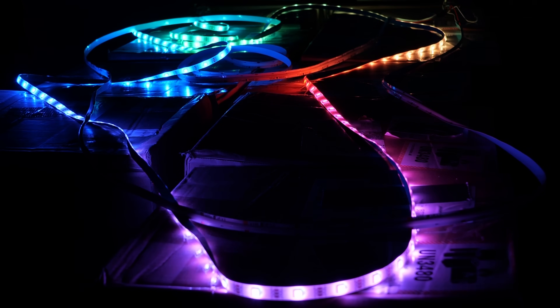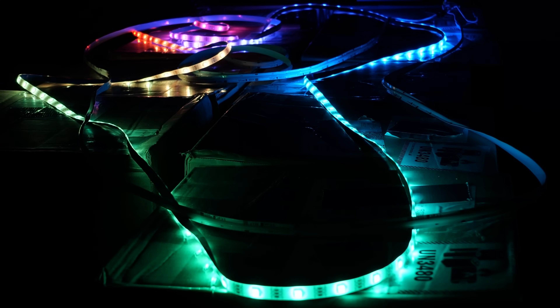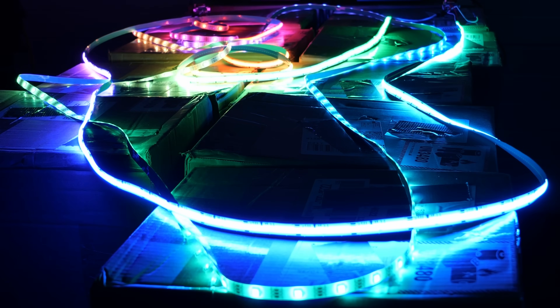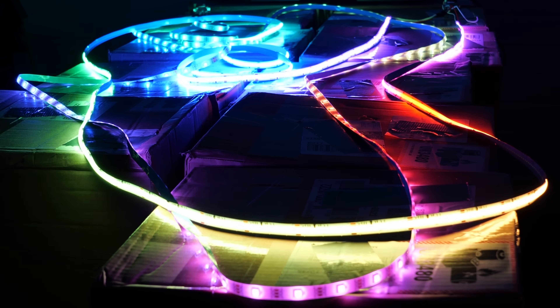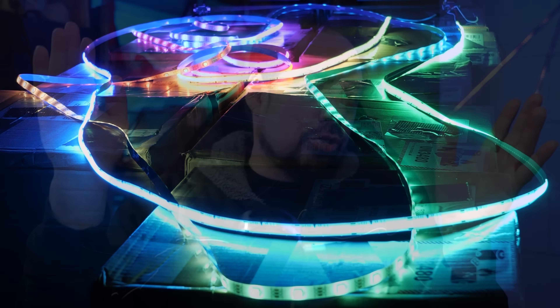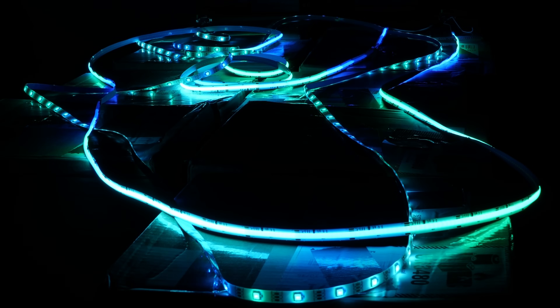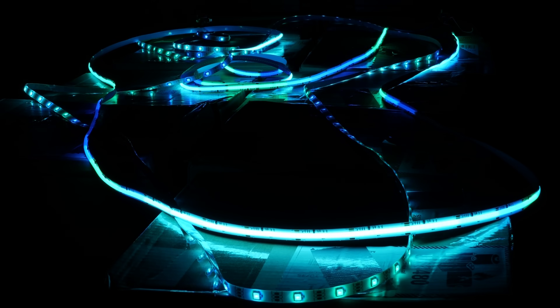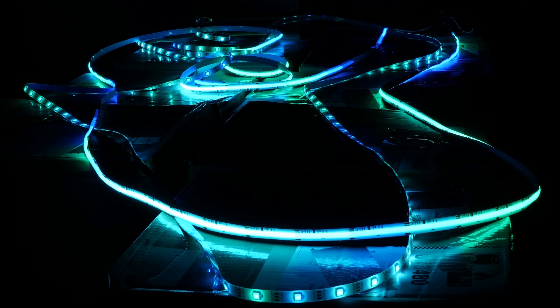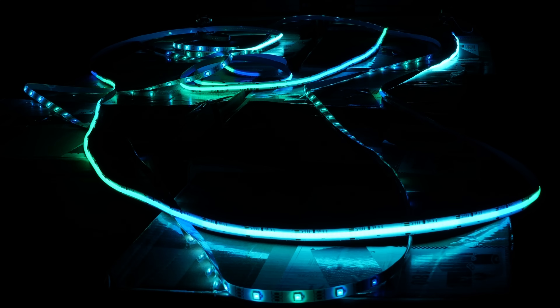Because this is a COB strip, it means that sections are much less defined compared to separate 5050 LED packages. For those, we often try to get diffusers and make them perfectly blend together. But if that's our goal, this new strip has it beat, since it's a COB material strip and basically already blends together perfectly on its own. No more asking what diffuser should I get for perfect diffusion and a neon look — any will do, basically. And that makes this new strip so amazing. Yes, it's only 20 zones per meter, but with any effect that blends color it looks like awesome multicolored neon, without the need for any additional diffuser or anything like that. So we have excellent diffusion right from the strip itself.